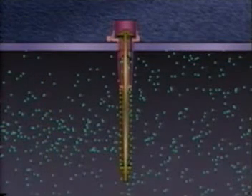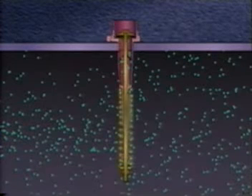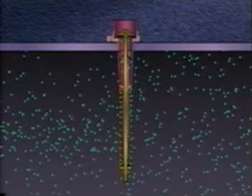The design of relief valves varies from container to container, yet the components and operating principles are basically the same. The relief valve has three major components: the body, a spring, and a seat disc and retainer assembly. A resilient seat disc provides gas-tight seals.